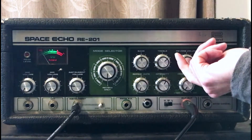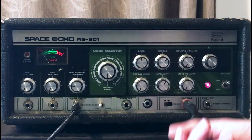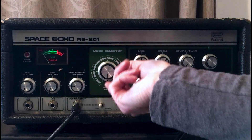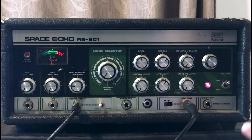So as you can hear, there's a really nice twangy, bongy spring reverb sound, which is great especially on drums. Now there are different modes here. I'll switch this over so we're listening to the first tape head. The way these tape echoes work is that inside there are various different tape heads, and as the tape goes through it's recording on these different heads. The distance between the tape heads determines the delay time. So let's have a listen.